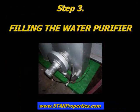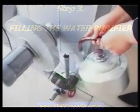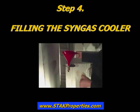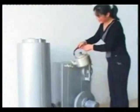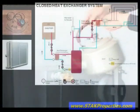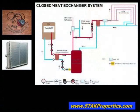Step 3: Filling the Water Purifier. Fill the purifier with water to a level approximately 5 inches from the bottom of the unit. Once the unit is full, place the end of the overflow hose inside the filling port. Step 4: Filling the Syngas Cooler. Fill the syngas cooler until it is completely full. Note that the water inlet and outlet may be connected to a recirculating pump and heat exchanger when extended run times are required or for hot water heating applications.